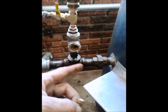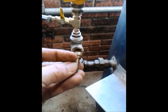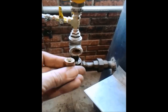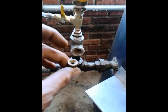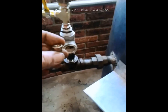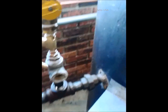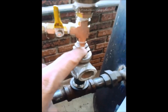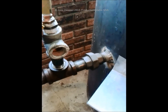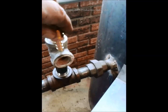The copper will hang out the bottom and stay loose up here so you can turn that fitting on. Then you shoot your epoxy in with one of those two-part epoxies around it, put a wedge in there to press it into place, and it'll stay — it ain't gonna go nowhere. That's how the oil drips, and then almost the same identical thing is an air fitting. My air box is just an air fitting that goes up the bottom of your valve. It goes into another piece of brass, and what I did is I took one that's half-inch, drilled it out, slid the other one inside, and brazed it together. That way you have this inside draining down into one of these.